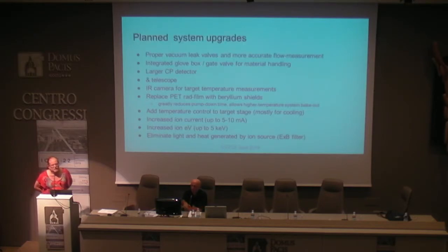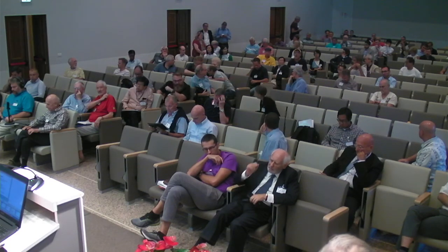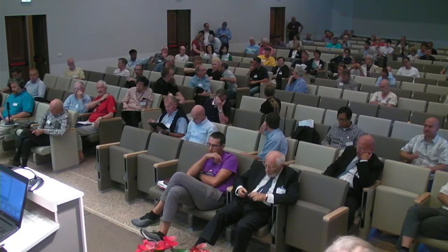Many of the features you're seeing there are very reminiscent of things that I've seen looking at gas loading with a high resolution measuring of the resistance changes. And that turned out to be extremely sensitive to vibrational input. There were regions of instability in what I was seeing that was dependent upon the loading. So there were areas where there was essentially no sensitivity, and areas where there were extraordinarily high levels of sensitivity. We probably will look at that.